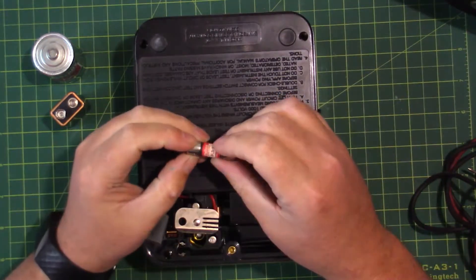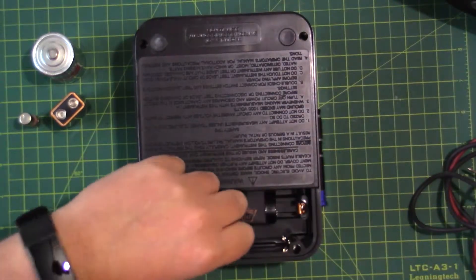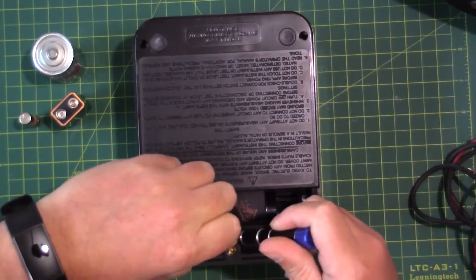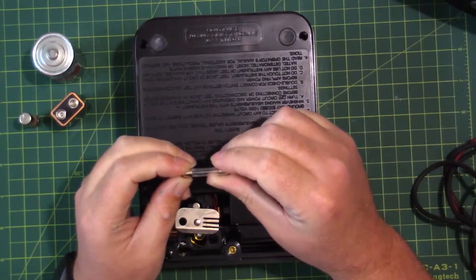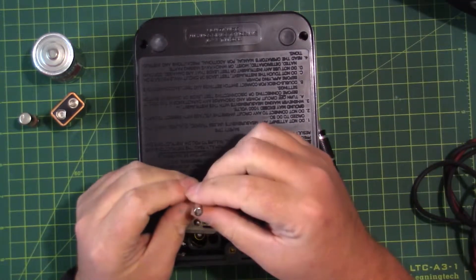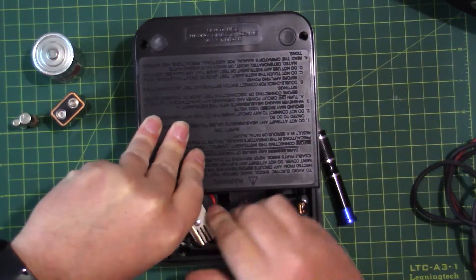Let's see what this one here is — VLS 2, 600 volt. So that's the big guy out of there. And then this guy here — come on, let's get it out. This one here is definitely blown, and this is a 1 amp fuse, 250 volt. I know I do have some of those kicking around. And then we'll just go ahead and rotate around and pop out the other one here.